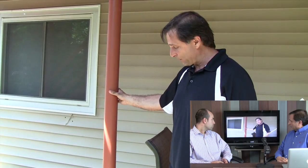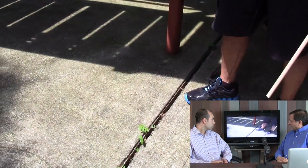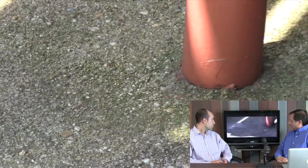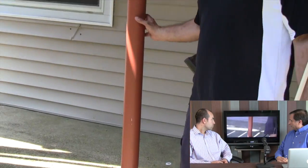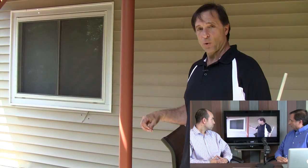The owner of the house did a very nice job of keeping it dry and painted, so it's held up for many years. But issues we have a lot of times with these lally columns is that they'll sit in water and corrode. Once they corrode and rust through, they have lost all of their strength. So we always have to use a six-by-six wooden post here.